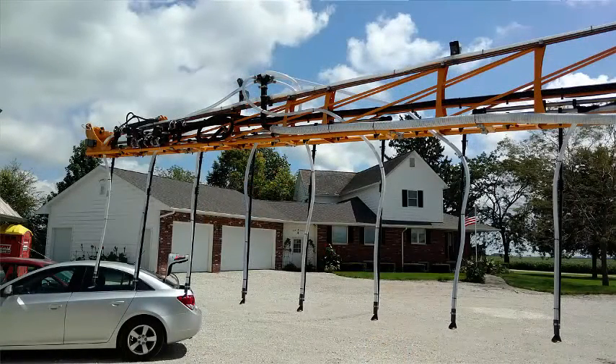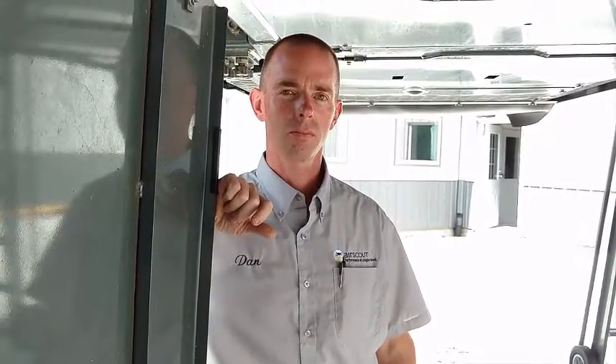With a 120-foot boom, you can run in the same tracks as you did for fungicide or spraying. That's correct — the idea is we don't want to cause any more damage, especially right before harvest. Why would I want to run down that crop? It's just money lost at that point. The canopy can't recover that area. So the least amount of damage for the biggest return — but also getting cover crop established before leaf drop, yet not too soon, since there's no light hitting the soil floor in soybeans like there is with corn. That's the challenge this machine addresses.